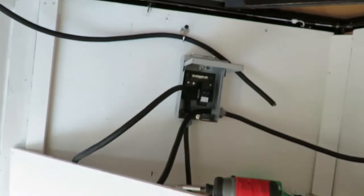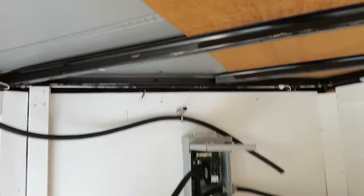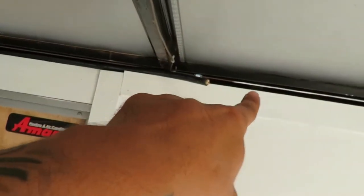All this is just dry fitted, this isn't even really on yet. I ran this wire this way because I'm going to have two outlets going through here, and I ran this one that way because I'm going to have one outlet right here. Because I plan on putting one machine here, another machine in the back, and then the compressor over here.